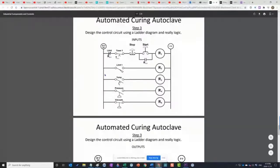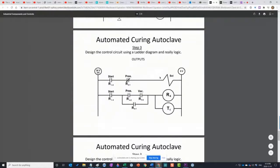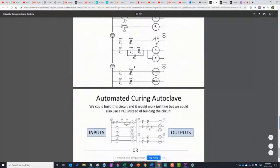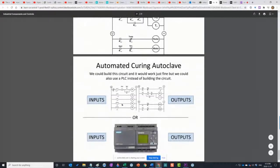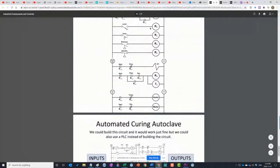So in this particular situation, I'm putting each one of the sensors or switches that translate the event into an electrical impulse into a relay so I can multiply. And then from there, I'm just adding a little bit more logic and a little bit more logic. And then after, I take all my inputs and put the logic together.